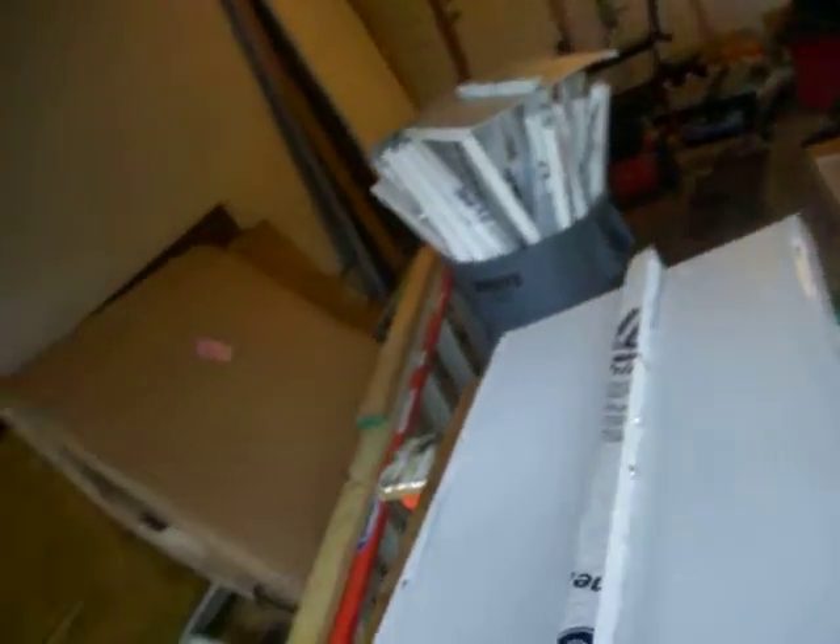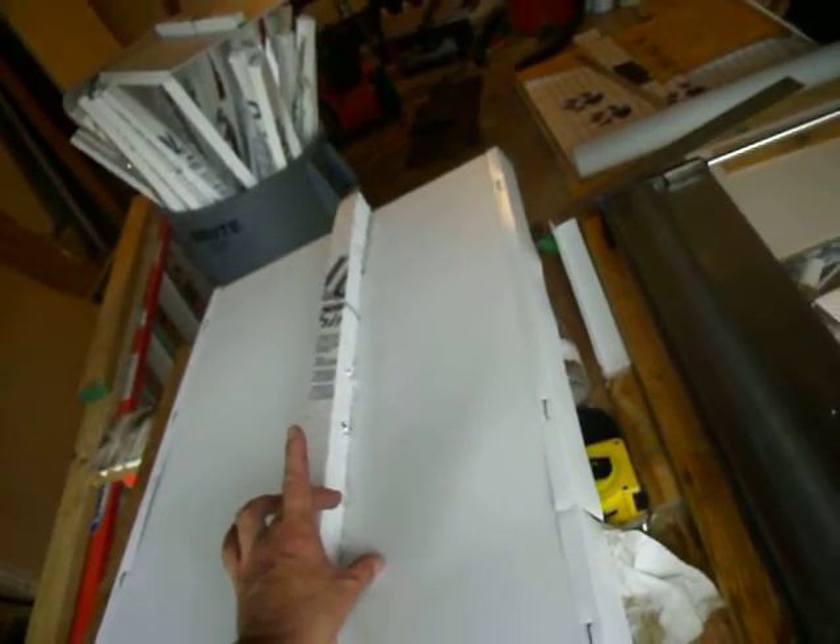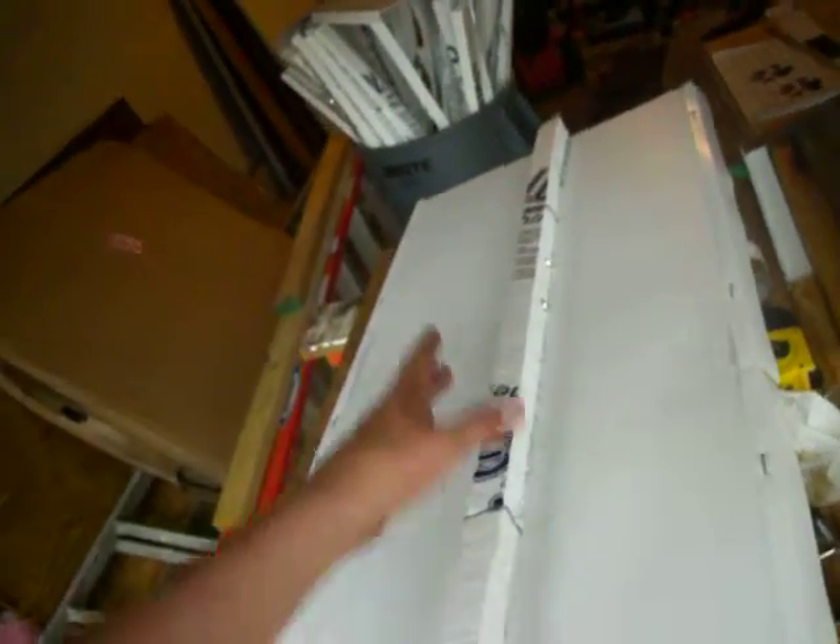I did some renovation work in a couple of the rooms upstairs, and while the drywall is down I figured I'd go ahead and put these baffles up. The baffles are made of corrugated plastic, like that signage stuff you put on your front yard. This is inch-and-a-half foam that's been run through the table saw to make a standoff, so there's a gap between the roof sheathing that allows the ventilation to happen.